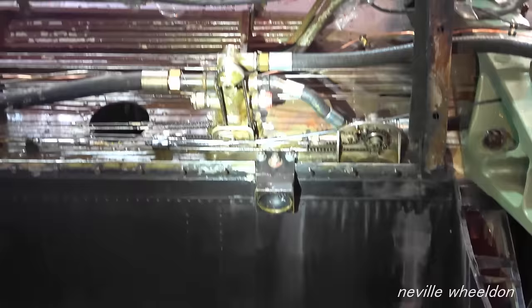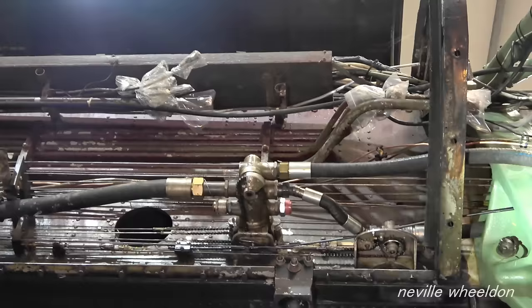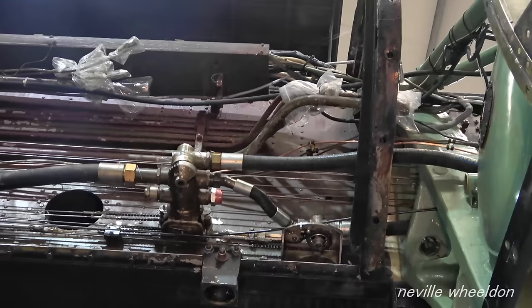Yeah. On this side here. You've got the small one, is it? The one on the right of the big fuel engine? No, that's the connecting point. From the main fuel cock to the shut-off cock, which is the number one. So the pipe you see on the right-hand side of that is actually the one that goes to number one. So that goes down the leading edge all the way to the fuel filter.